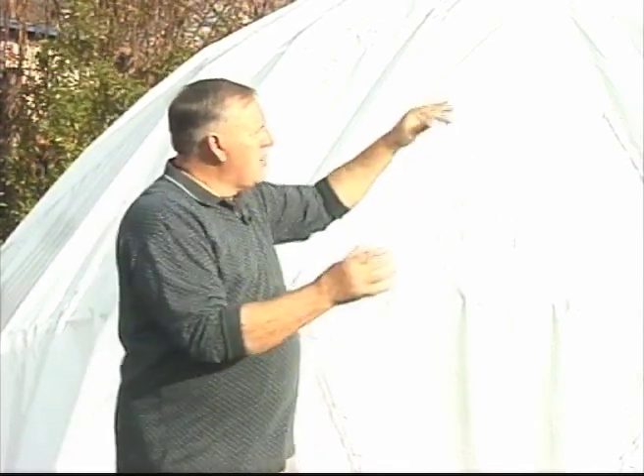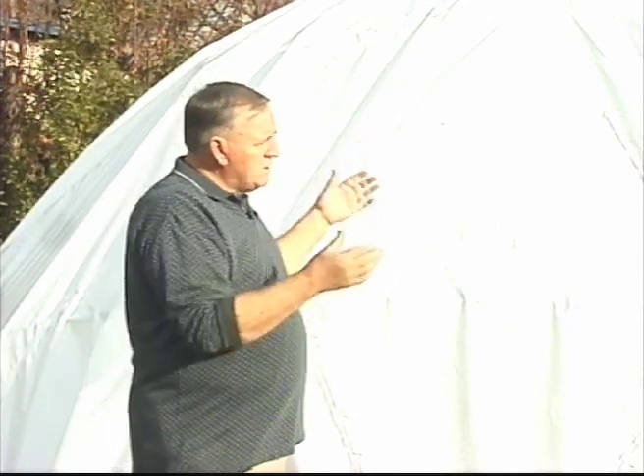You'll notice the cover material. We researched a lot of cover materials and decided to go with this because it's a lot like the material they put over the Denver airport — it uses new space-age polymers. It's extremely resistant to ultraviolet light, rated at over three years of constant exposure. It has a grid system built into it so that even if a tree were to puncture a hole in it, it normally cannot be ripped even under extreme pressure, so you don't get shredding of the cover — very durable, very strong. To keep the cost down, we did not cut and sew it into a dome shape. We use a large square piece of material that goes over the dome, and to fit a square over a dome you need to make pleats. The pleats, although not aesthetically pleasing, are very strong because you have no seams to rip.